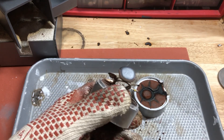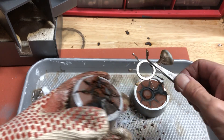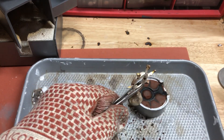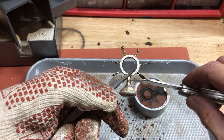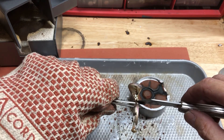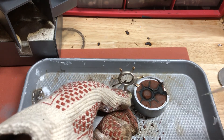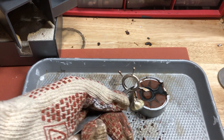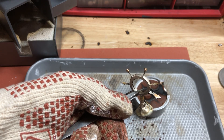Maybe the vents were a little too big, but they're easy to cut off. I'm more concerned with getting a great casting, and this is a great casting. If you look, I have enough sprue on here that it's going to be really easy to cut off. Just take some little nippers and cut those off and you've got yourself a great casting. I think we'll stop it right here — thank you!